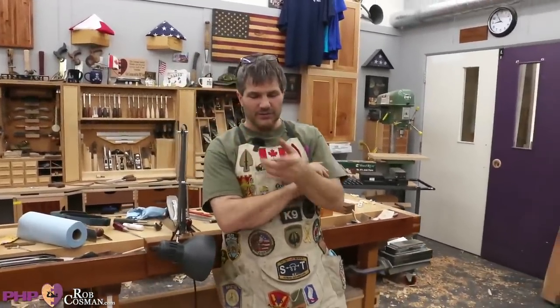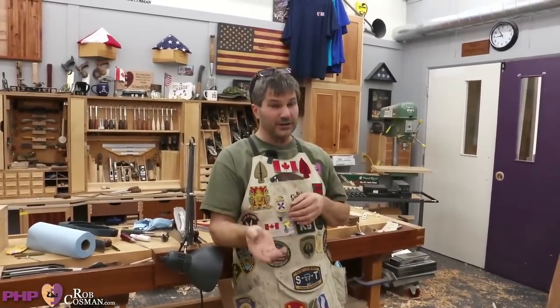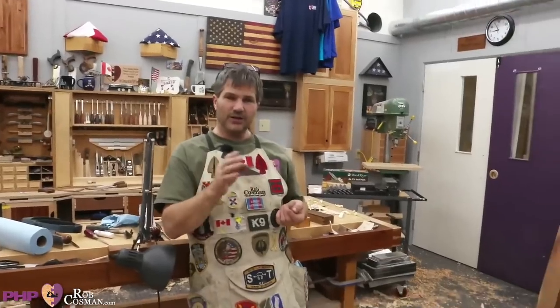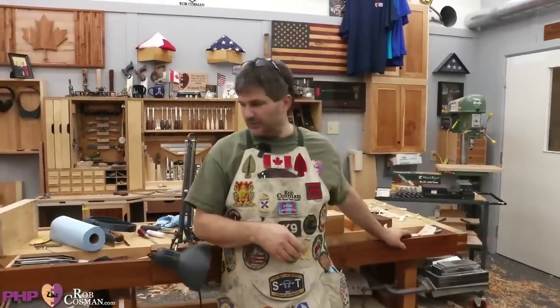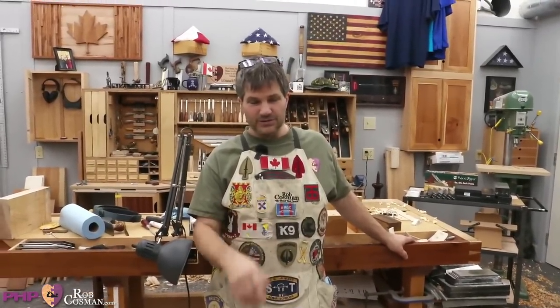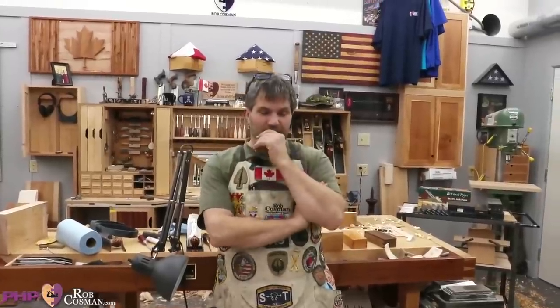So to finish what Jake's saying, if you get to your 8,000 and you can still see scratches, you're not looking at 8,000 grit scratches. You're looking at 1,000 grit scratches that you didn't chase away with whatever your in-between grits are. And the only solution is to go all the way back and start over. It's a painful process. I used to tell people, expect to spend an hour on a chisel. Now, the good news is you never have to do it again, provided you don't loan your chisel to somebody. But the pressure too, if you apply too much pressure, that throws it out of whack. There's so much.